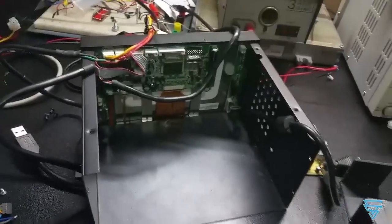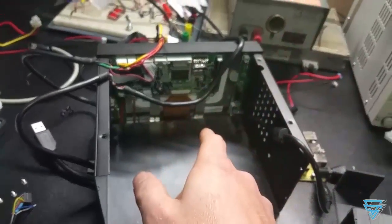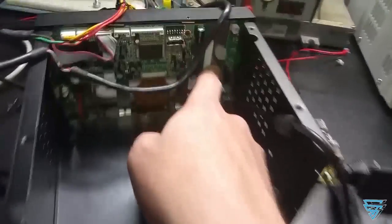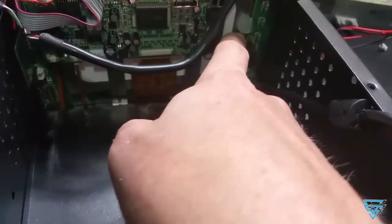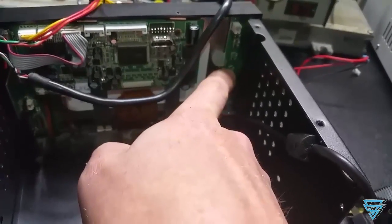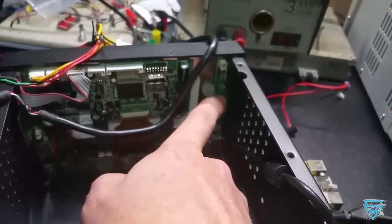The reason why I haven't moved it yet is because I will say that this board is a little finicky. It bolts top and bottom, and gives you USB buttons you can program on the front, and it tweaks so the buttons in the middle don't quite push. You'll see I put a little bit of hot glue there to hold the board flush against the metal. I don't want to get this metal too hot though. I was going to put a 3D printed bracket that pushed in on it, but I didn't want to apply any pressure to the screen because that starts warping the screen. So a little bit of hot glue holds the board flush, so it's good.